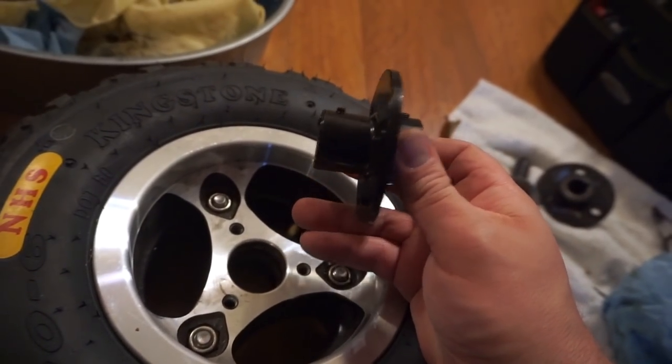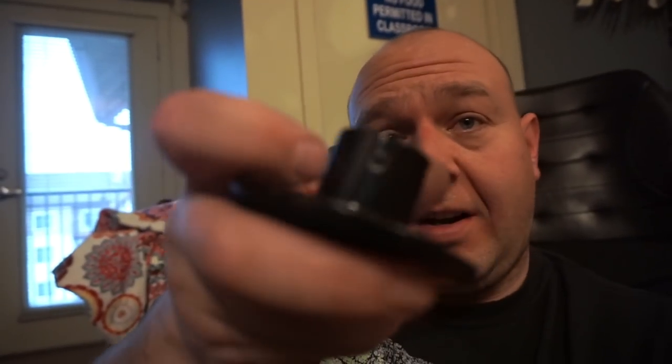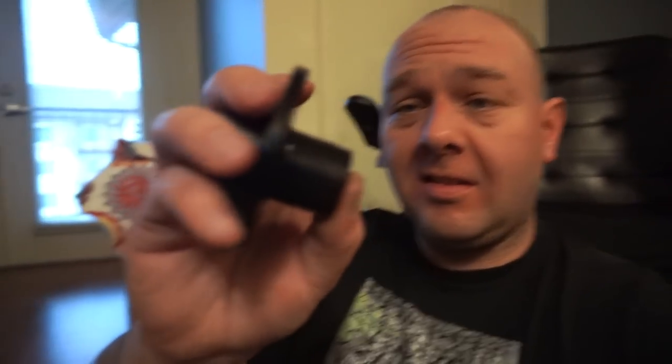I just had these modified so they wouldn't have an issue, but once it's down inside the hole you can't get to it. You can get to this one, which is better than nothing. I think what I'll have to do is put some Loctite in there and preset a little bit of tension on it — that way it's giving some force. It's not going to be as much as necessary, but having this one set screw fully tight should be okay. Not ideal but it'll work.